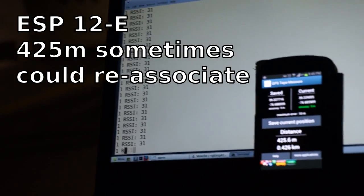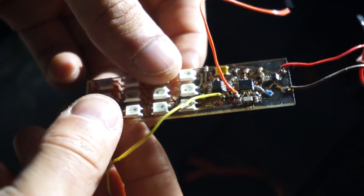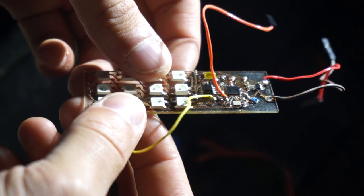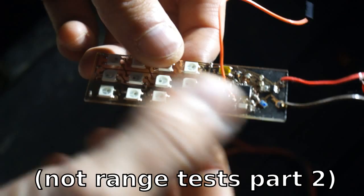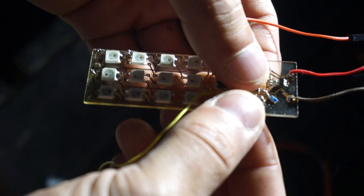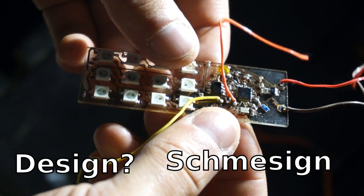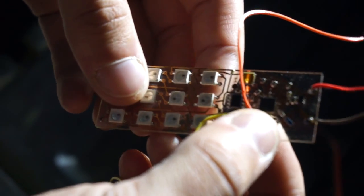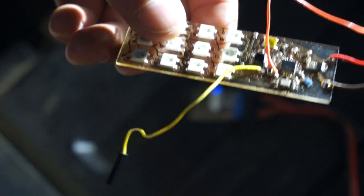A while back I had a problem making a single layer glass PCB with an ESP on it. I thought that it's just something you could not do on a single layer. Turns out I was wrong — it was a really simple thing. You're going to have to look at the next video I'm releasing to find out what made this work. At any rate, I have this single layer board with an ESP8266 on it and an itty bitty ceramic antenna. The design of this is just plain awful — it's not even a double layer board, so there's no ground isolation, and on top of that there's a big ground plane running right behind the antenna. Everything about this board is just wrong. So let's see how well this thing does.